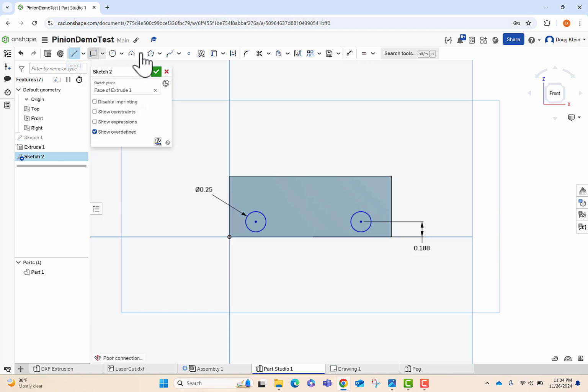And then my last thing I'm going to do is develop a line, and I'm going to use a construction line. You'll see that it's different here. So we've got a dotted line here showing it's a construction line. I just pushed L there to restart that. And I'm doing another on the other side. They're both horizontal, and I'm going to set them to be equal. And so whenever I space one out, the other one will go that same spacing. And so then I can just adjust this one as 1/4 inch. Everything's black in my image, so I'm good to move forward.